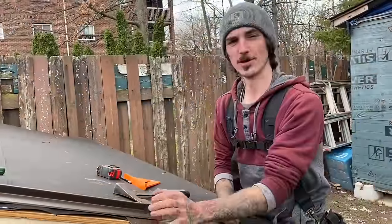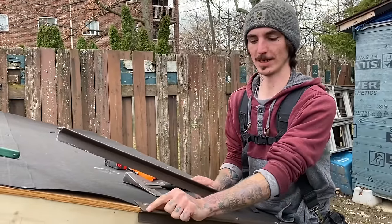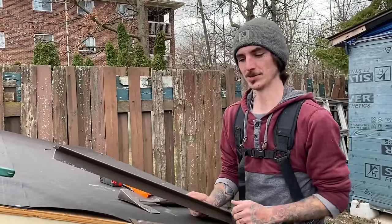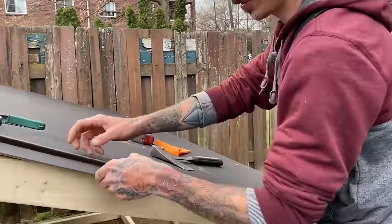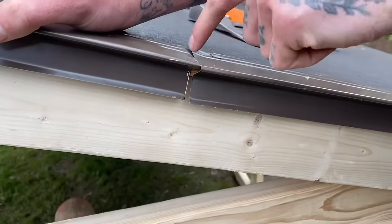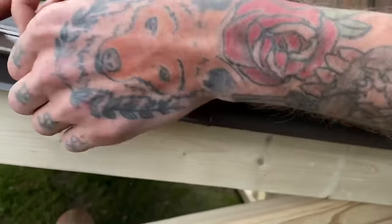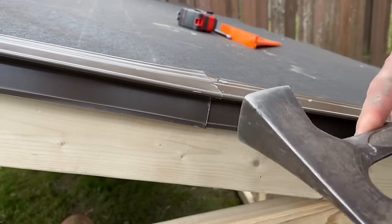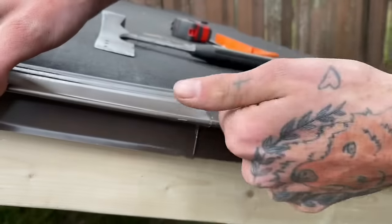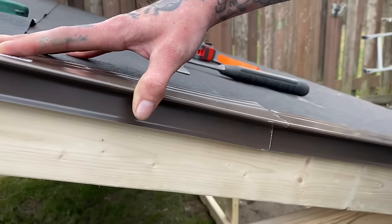When you're installing up your gable end or even on your bottom and you get to your next piece of drip edge, you want to interlock the ends by about a quarter inch. That way they lock in together and it makes a smoother finish. Some contractors will just butt it up, which leaves a gap and water can penetrate below the next piece. What we're going to do is come over top, take your hammer, and just lock it into place. Now if water gets onto this drip edge from any wind-driven rain, it's going to come right down over top of the next one to the bottom of the roof, and that'll protect your plywood fully.